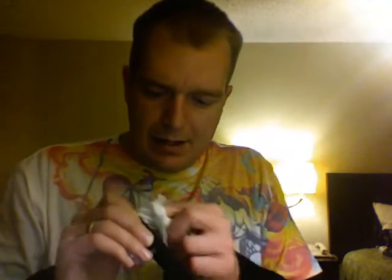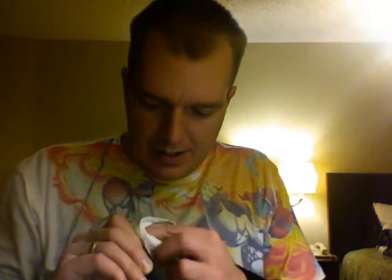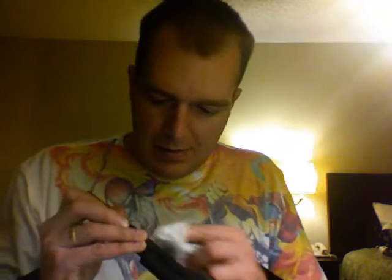And as you can see, it's just a slight film. You don't want any drips, but you want to make sure you coat any metal part with just a little bit of gun oil. Even the exterior, even though it'll eventually wear off, I like putting it on there just to give it a good coat. And metal is actually porous, and so it'll absorb this oil, even when it looks dry, it'll have that absorbed in it. So now we put the pistol back together.